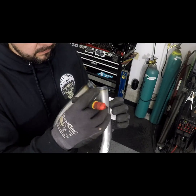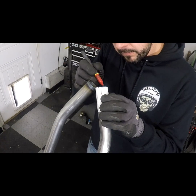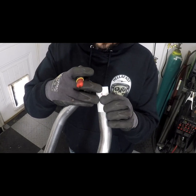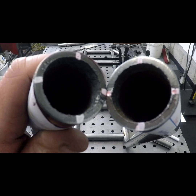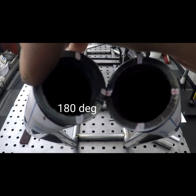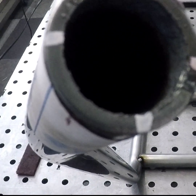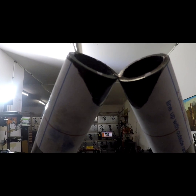Let's move on to marking the notches for the head tube. I'm taking the right side template and wrapping it around the tube — it makes it really easy if you tape it. I'm also making some marks to better explain the rotation angle for this template. For demonstration purposes, I marked the end of the tube. The one I'm touching right now is the right side, so we're going to take the right template. If you're looking at the top mark, that indication is zero. The 9 o'clock position is going to be 90, the 6 o'clock position is going to be 180, and then 270. The blue line on the template — we're going to try to set that at about 115 degrees. With the right side set at 115 degrees and the left side set at 245 degrees, you can get an idea of what the notch is supposed to look like, and test fit it with the fork head tube.